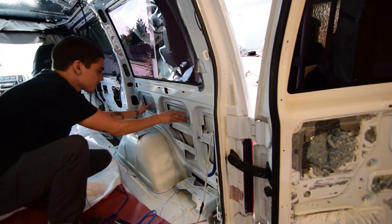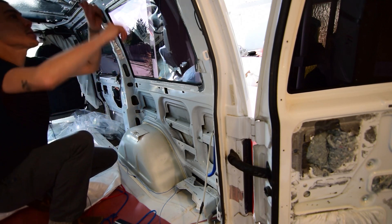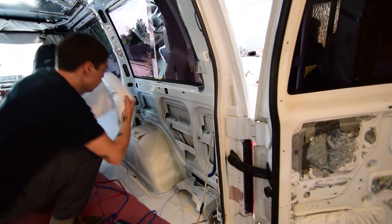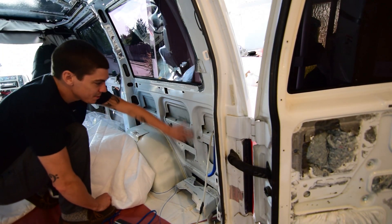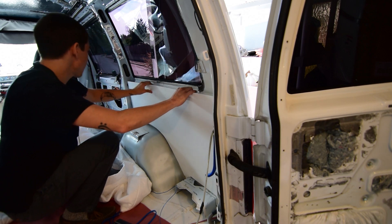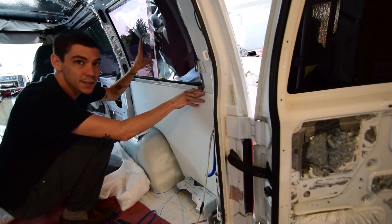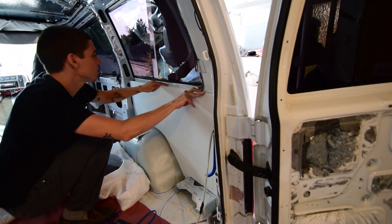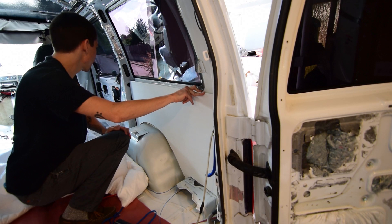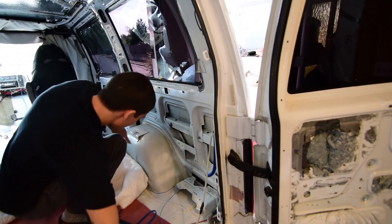So you see I've got these cavities in here which I'm going to double and triple up with the insulation. I'm going to stick this up here out of my way - try not to scratch my beautiful window tint, thank you Cody. I'm basically just going to cut this stuff and wedge it in here, then do one final layer maybe two over the top, and then my Luan. I decided just not to paint this because you're never going to see it. Because of the windows I am going to get condensation eventually, so I'm going to create some kind of little channel for it to funnel into where it can just sit and evaporate the next day.